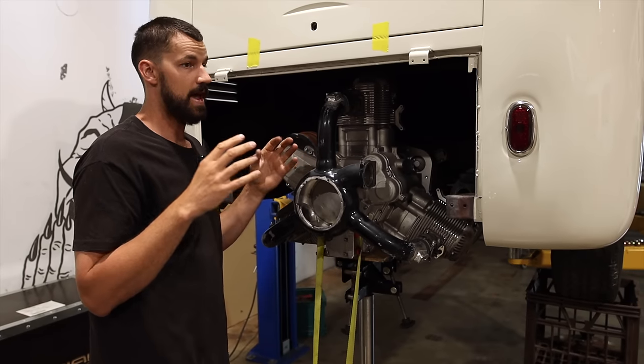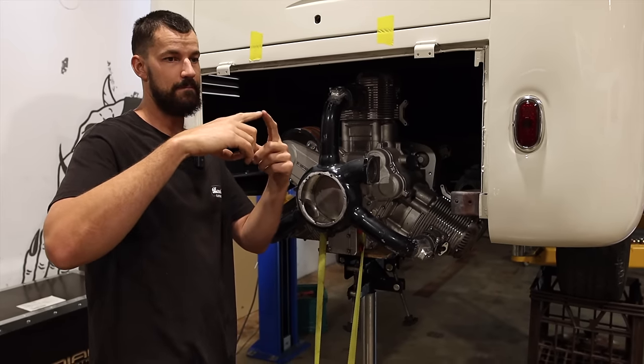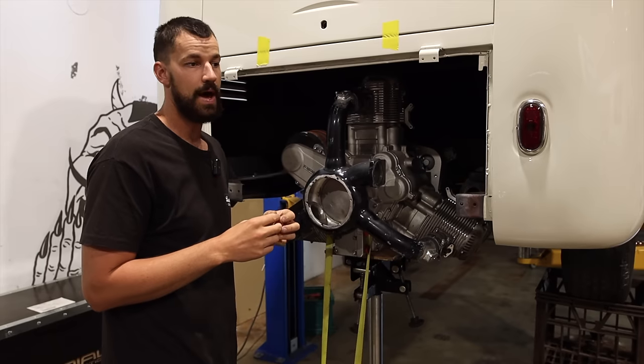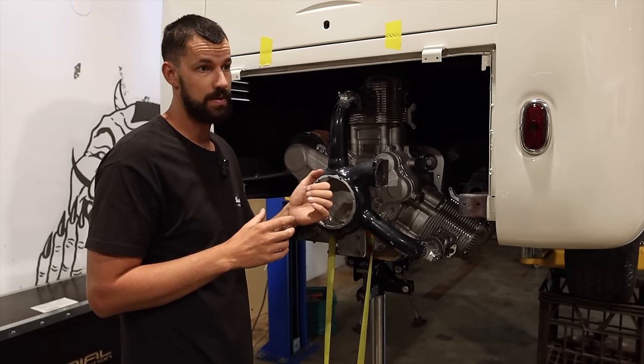So with that angle, the higher we go up, the steeper or sharper our u-joints are going to be in order to try and make it work. And you don't want those to bind. I want this thing to shift really, really nicely.